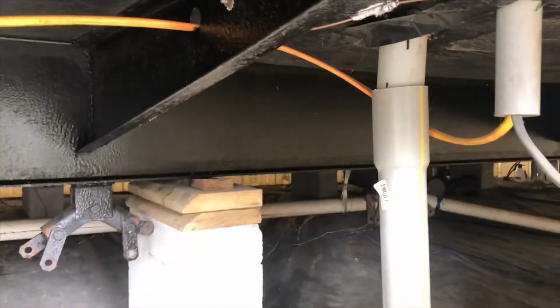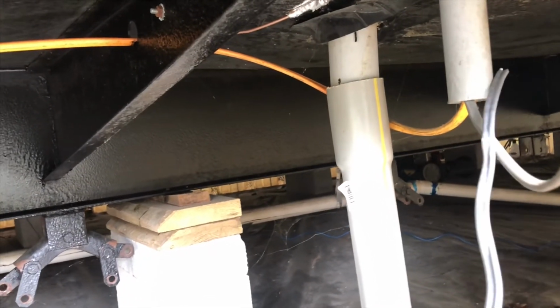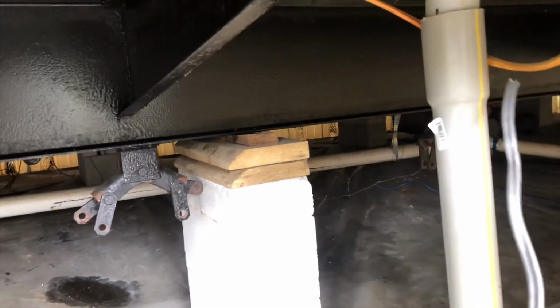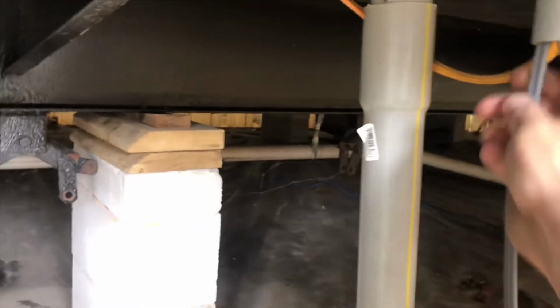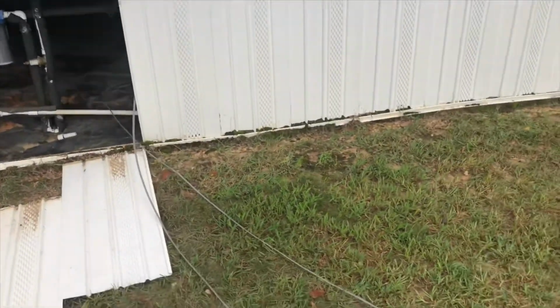All right, so once you get your wire ran underneath the house, you're gonna wanna go inside your breaker box. Hopefully you'll have one of these extra auxiliary lines that do go straight into the breaker box. If you don't, you're gonna have to go up beside it. It's much, much more difficult. Just luckily we have this one. So all you gotta do is just go inside of it like that. Okay, that's good right there. And you'll pull your extra through the breaker box, and then you can cut off the excess there.